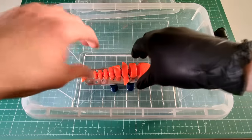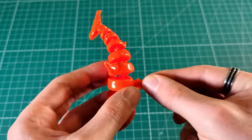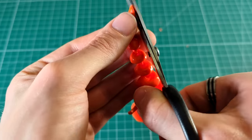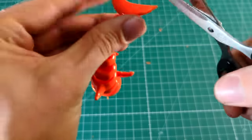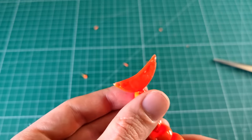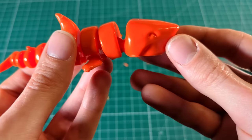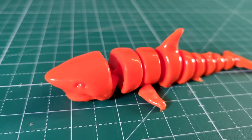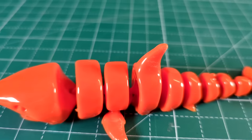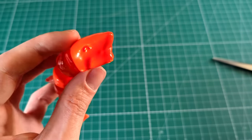When I took it out, it's literally almost liquidy — you can see the surface is tacky and I can deform it with my bare hands and also cut pieces off of it with regular scissors. It's that soft when it has reacted with the ABS for a longer time. Don't worry though — the print will get rigid again, as hard as it was when you printed it. The state is only temporary. If we take a closer look at the print, you can also see it is basically as smooth as it can get, and it also got shiny — this is a side effect when you melt ABS with acetone.